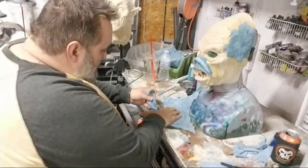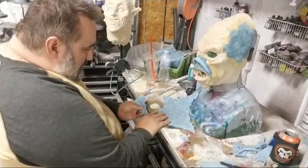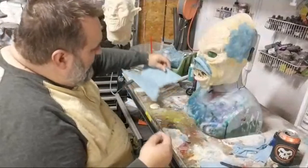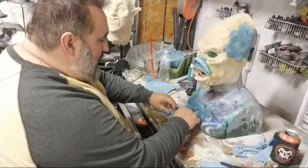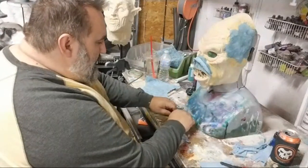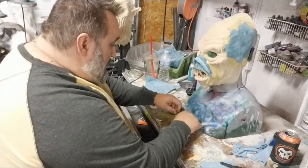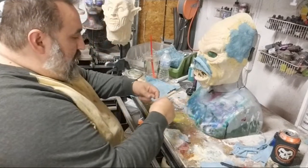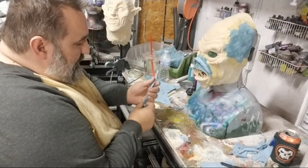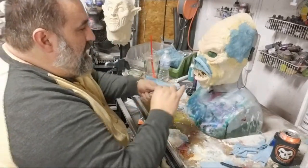I've never layered up contact cement that much. Will it shrink after curing? Not much. Contact cement doesn't really go through a curing process so much as a drying process. What happens is what is in it is evaporating away. And as soon as that accelerant or whatever you want to call it goes away, then it's just that plastic that was suspended in that suspension.